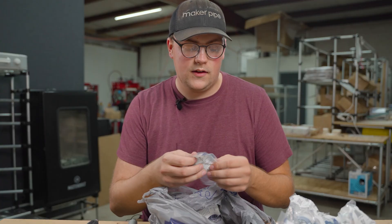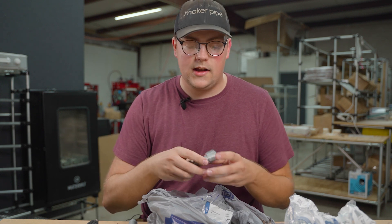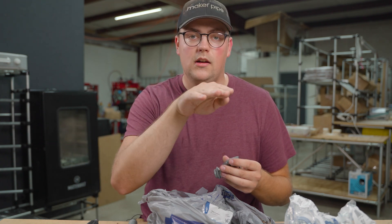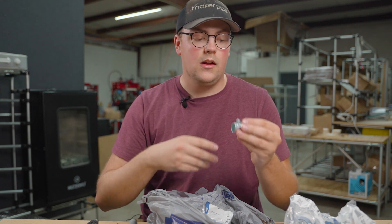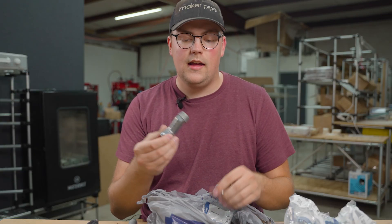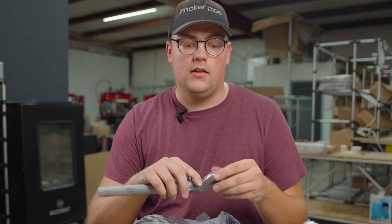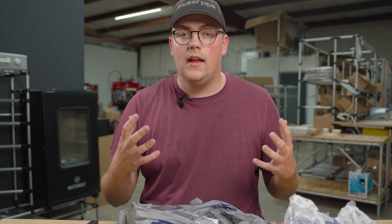Last but not least is an offset connector with a set screw. When working with conduit, you'll have to bend in certain situations to achieve angles and route cables correctly. Another type of bend you have to do is an offset bend — the conduit goes straight in and then has to offset a little bit to align with the electrical box. You can bend those offsets by hand with a hand bender and then use a regular connector, but you can also do it with this pre-designed offset connector. Just like the other connectors, it has threads on one side and a nut to secure it to the electrical box, and on the other side a set screw connector that secures the conduit so you can run your cables through it offset into the electrical box. All of the things we've looked at today are to solve specific problems and follow building codes.